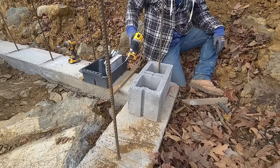Last thing to do here in prep for tomorrow is to take this water level around and get a consistent line or a consistent mark on all four poles. Doesn't matter where it is. Let's just do that real quick. And I'm going with the bottom of the bubble. And there it is. Whew. All right. It's like I'm holding my breath. Okay, there's one. Now the bucket stays there.